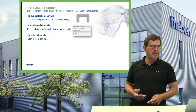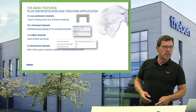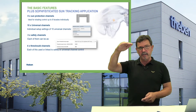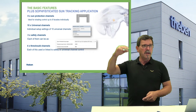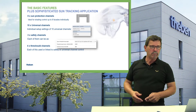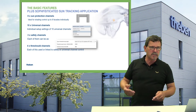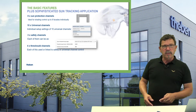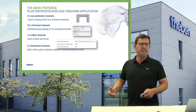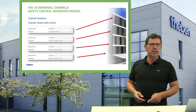You can use these safety channels to do whatever you like. For example, in a 10-floor building where each floor is separated by wind speed threshold, the blinds on each floor can move to their upper position when that floor's wind speed threshold is exceeded. Similarly, depending on specific brightness thresholds — for instance if outdoor brightness drops below 100 lux — you can use that channel to illuminate your garden path or garage. There are also logic links inside the weather station you can use for your purposes.